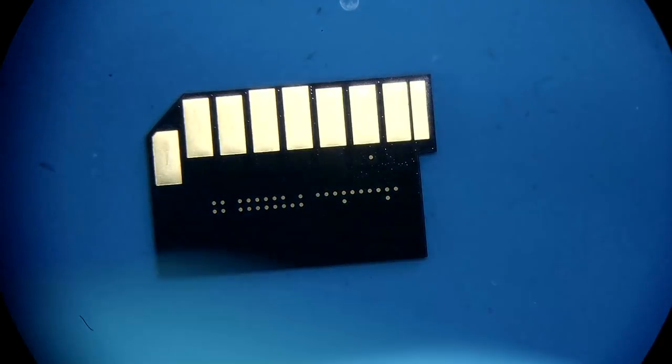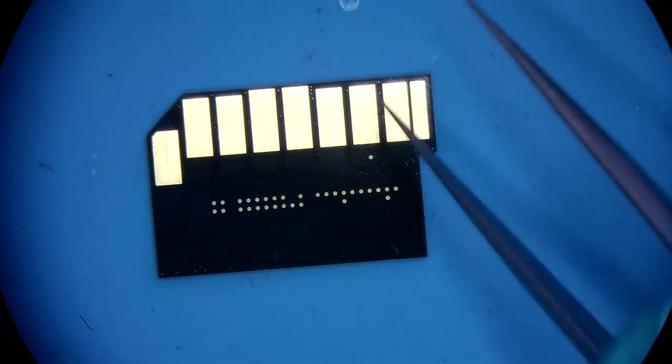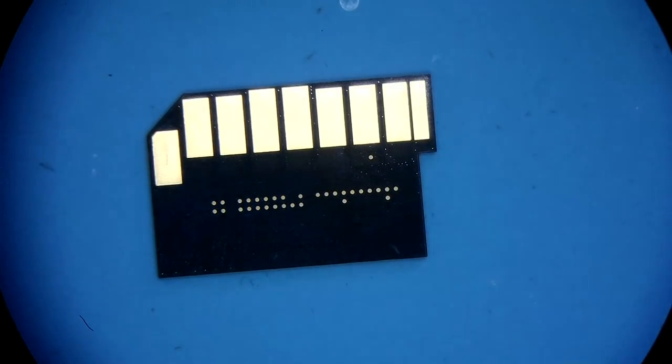This is the first time I see a pinout like this. I do have a schematic for it. One of the vendors does have it in the database, so no pinout development in this case is needed. But we're going to mount it up to a NAND breakout, and we're going to use our traditional NAND recovery tools to communicate with the storage directly.